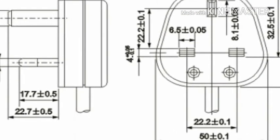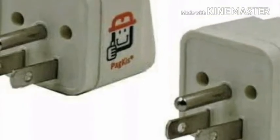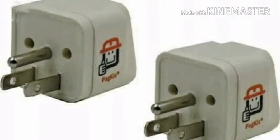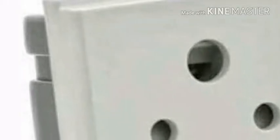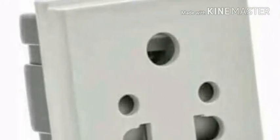Reason three: the more the thickness of the conductor, the less the resistance in the path for the current to be grounded. This is for safety against shock — any leakage current will take the path of least resistance through the earth pin to ground, rather than through the person operating the appliance.